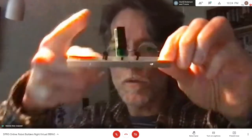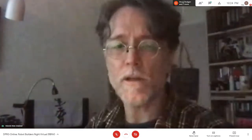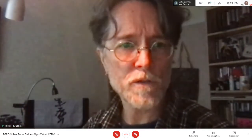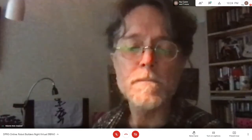I was going to ask David, do you think that on these normal Sharp sensors, the 1.5 meter ones, you need to have a shadow box on those if you've got 5 of them on the front of your robot? I don't think so. They're real well designed to not interfere. Okay, good to hear. That's a good question, though.